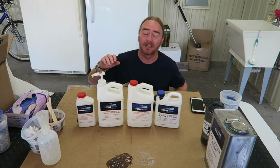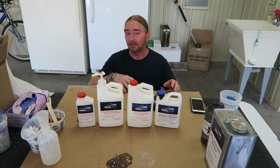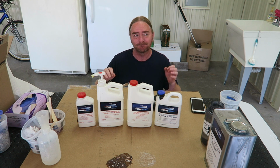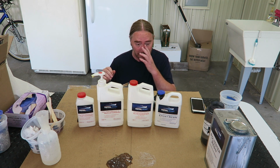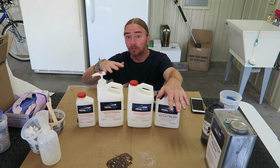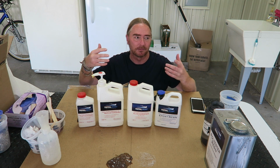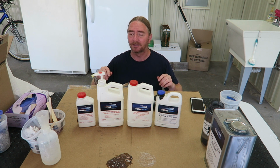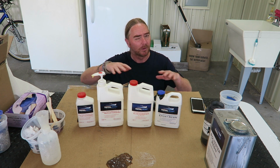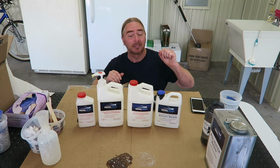All right, so now up to this point, we've been talking specifically about polyester resin. We haven't really touched on epoxy. However, a lot of things that we covered with polyester resin are very applicable to epoxy as well, but there is one more slight variable that can give you a little bit of an added edge. Looking at the Total Boat line of epoxies, I typically tend to use their 2-to-1s, but they also have 5-to-1s. The hardeners and the way that they're mixed, I believe, I can't say this for 100%, but I believe the rate at which they start to cure is pretty comparable between the 2-to-1 and the 5-to-1.